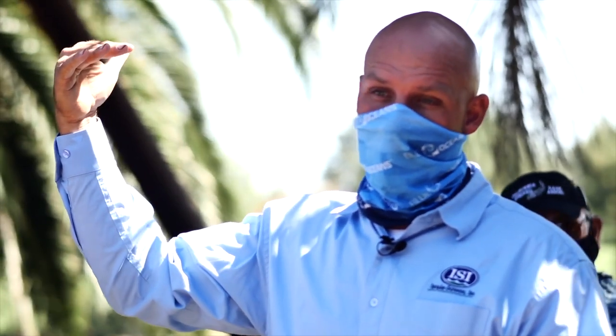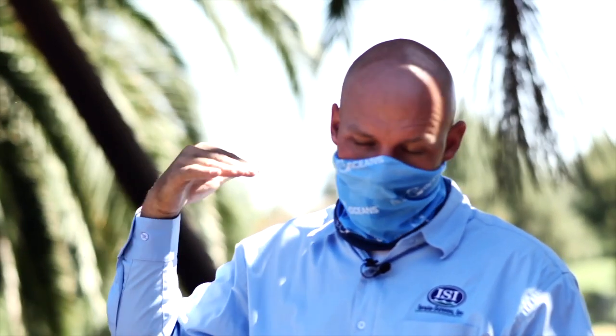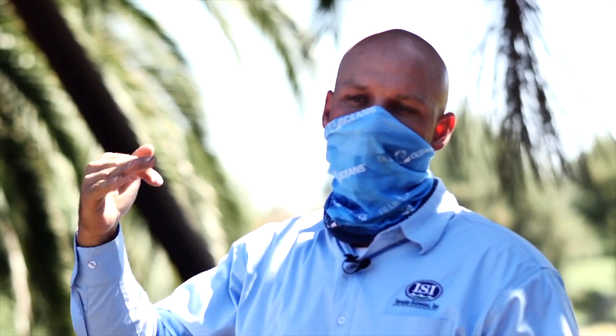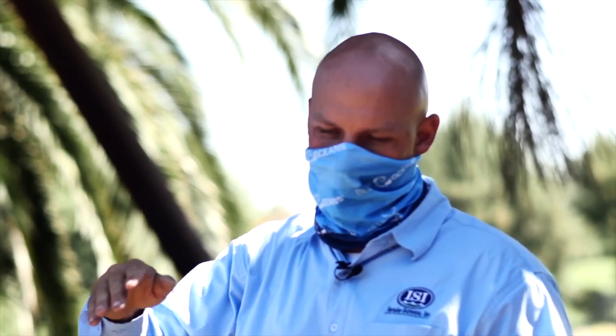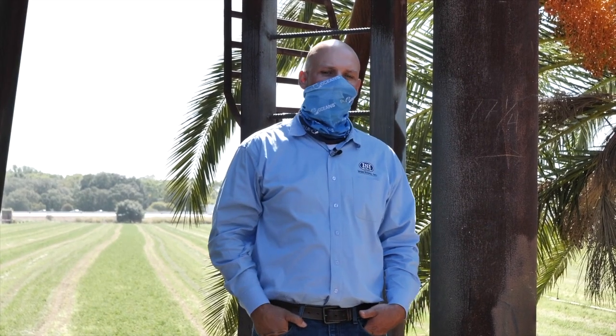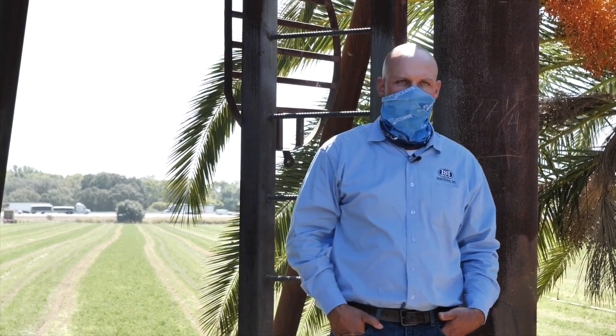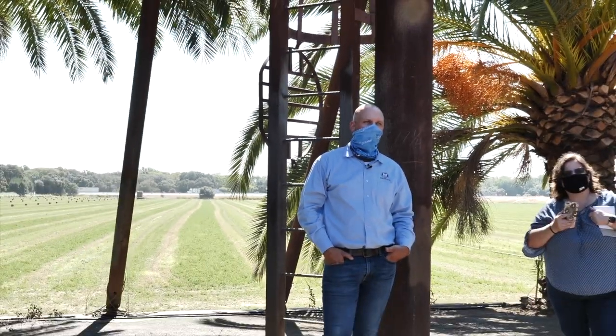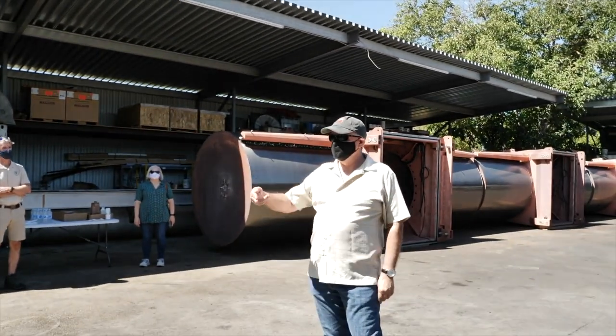Well, no, that's what I'm saying. There would be a differential sensor in the background, but we wouldn't want to rely on a differential to activate a cleaning cycle. We'd want the cleaning cycles to happen on a regular time schedule, set to every hour or every 6 hours, whatever it might be. Then if something happened where it needed to clean more frequently, you would see a differential, and it would go through a cleaning cycle. Our design also includes a hardwired cutoff. If the drop ever got too much and the screen wasn't fixing it, it would automatically shut off, going straight to the power source and cutting it off.